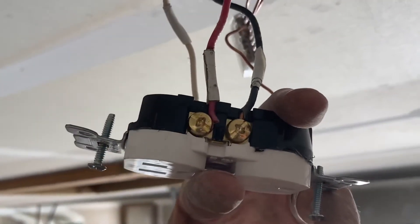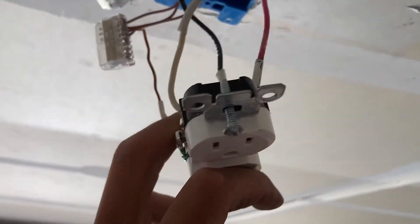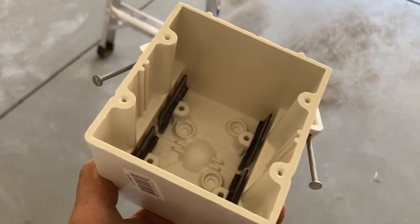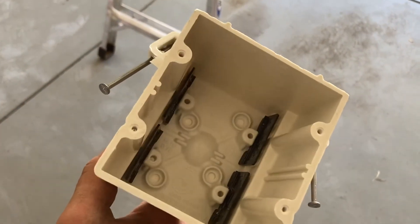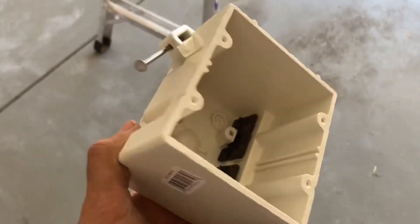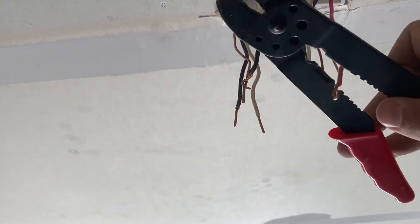The red and the black were originally connected in a wire nut, but for this you have to put the red on one of the wires and the black on the other, and then you just have the one white on this side — because this is your switch controlling power on and off. I'm using these fiberglass ones with the nail-in just because they're more sturdy. This is a lot more sturdy material than the blue ones, especially since this is in the attic area — you don't want things getting really hot and warping up there.